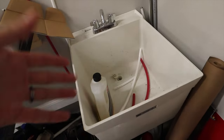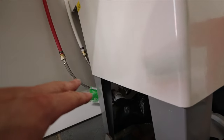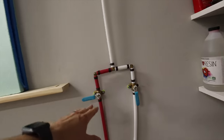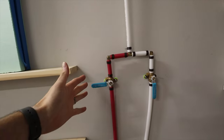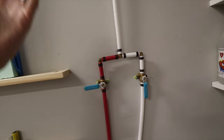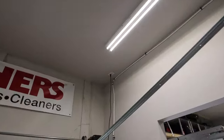It's just a matter of where you have water — that's the tricky part. In my garage I have a slop sink, also called a wash tub. I took some tees off the shutoff valves down below and ran PEX tubing up to shutoff valves here. So yes, I have hot water and cold water. The cold water is on all the time, or I can shut it off here. The hot water is great for wintertime, or if I have a wrap that needs to come off — hot water really softens up that glue. So I have pressure going up one line all the way over to the garage, all PEX tubing.